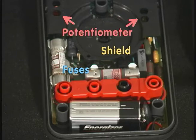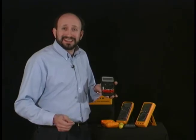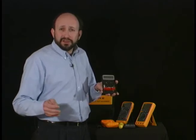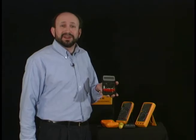You'll also notice that there are some potentiometers here. I know it's tempting, but don't rotate those. Those are for use only by qualified personnel when you get your meter recalibrated. Similar to a torque wrench — you wouldn't want to use a torque wrench if you don't know the torque settings. You don't want to use your meter if you think it's out of calibration. Typically every two years or so, send it back to a qualified service center and they can recalibrate it.